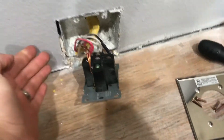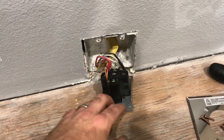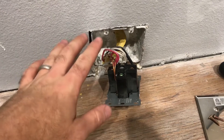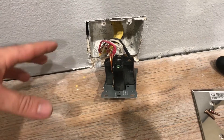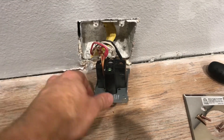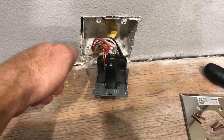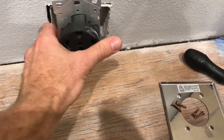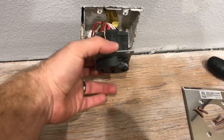Just think about this — most times you have a big plug like this, it's up higher in the wall and it doesn't matter. But particularly for the stove, I thought this was ignorant when I put it in; I was surprised it was that way by design. For a stove, they are at the floor, and the bottom of your stove has a cutout. So if you're hooking up a plug for a stove, save yourself some headache — rotate this plug 90 degrees at install, at least double check it with the cord you're going to use. Or see if you can find a cord that is rigid out to the side, because mine is rigid vertically down, and that's the only cord they had at Lowe's.